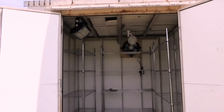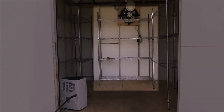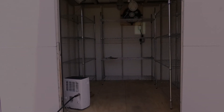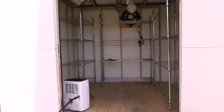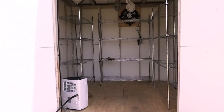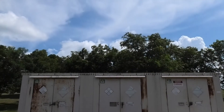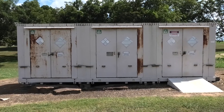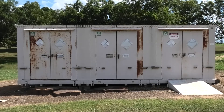Once you've decided on the location, it's time to prepare your space. The materials you'll need include wired shelves, a ceiling-mounted heater, a mounted fan, temperature controller, thermometer and hygrometer, and a dehumidifier. First, make sure that the space you've selected is ventilated, insulated, and has electricity before you proceed with setting up the equipment inside your dryer. The shipping container we used didn't have these things previously installed. If you would like a more detailed guide on the materials we used and the steps in that process, check out our upcoming fact sheet that will be out later this fall.